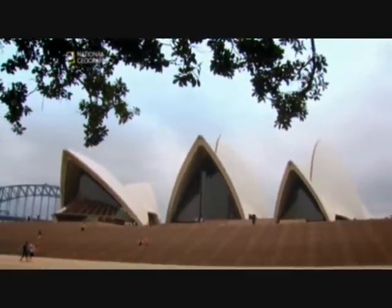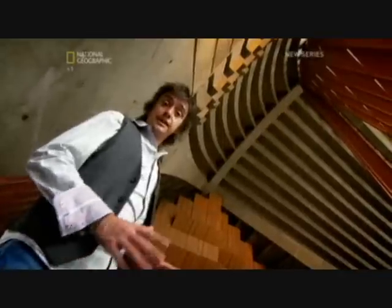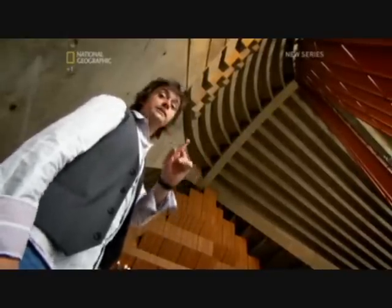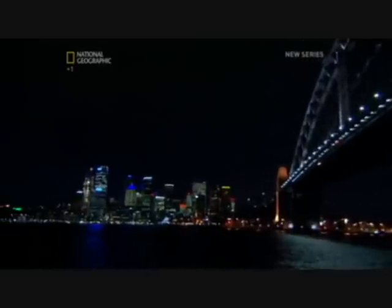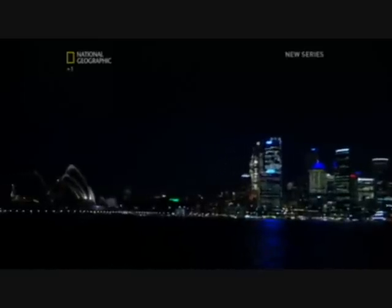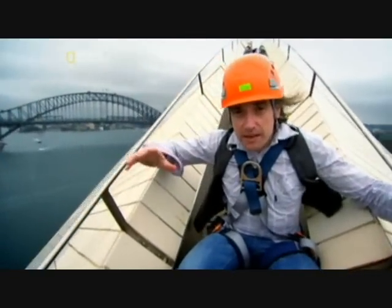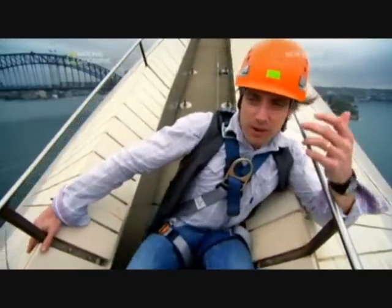I haven't yet found a button you can press to release the tension. Because squeezing the concrete also makes it stronger, it allowed thinner and more delicate-looking sails, perfect for Utzon's design. Post-tensioning the sails meant the engineers didn't have to build huge columns inside the opera house. But not even the tensioned steel was enough to lock everything in place. Heat causes the concrete to expand, and it contracts when it cools. Relentless swelling and shrinking could force the concrete segments apart — not good for watertight joints. The tiniest movement could have been fatal, so it had to be glued.